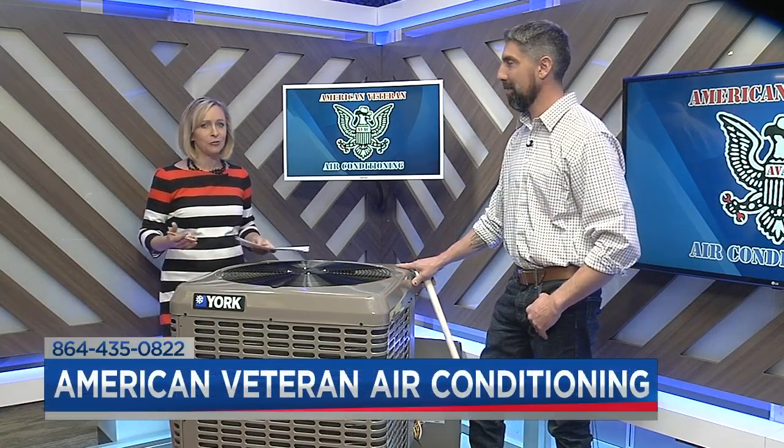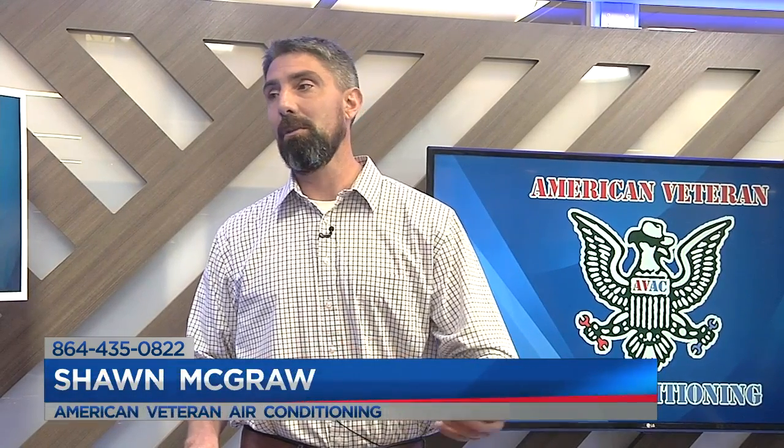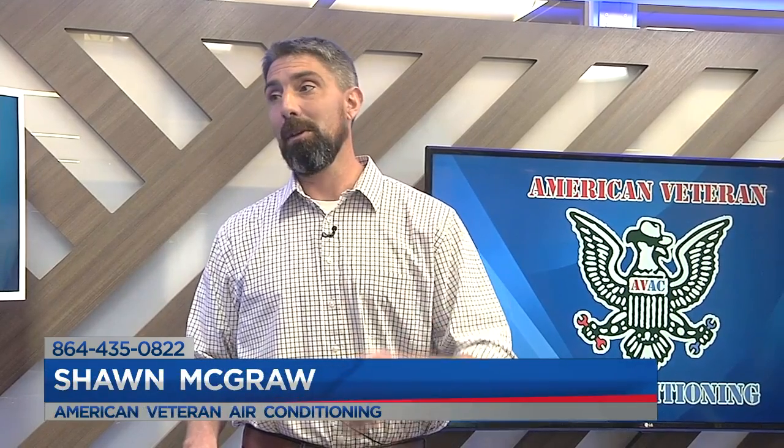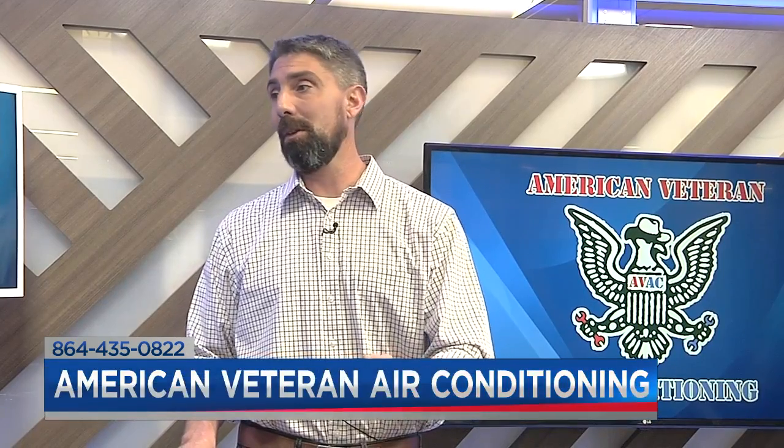Checking and replacing your furnace filters and AC filters is absolutely crucial for proper maintenance. We get asked a lot how often to change the filter, and my response is generally: when it's dirty. In my house, I have a bunch of dogs running in and out, so my filters get changed about every two weeks, where someone else's might last a month to a month and a half. You don't want a really high-efficiency filter because that blocks airflow. Making sure that system can breathe is crucial.